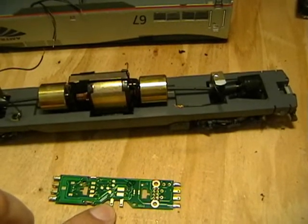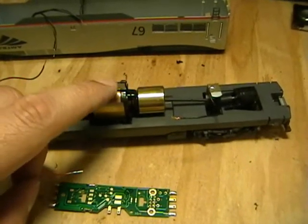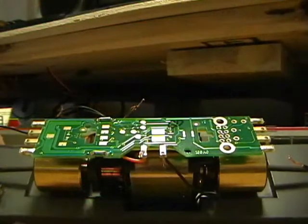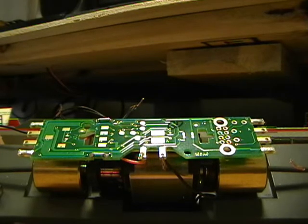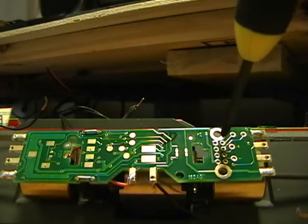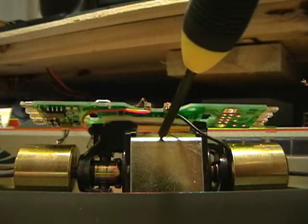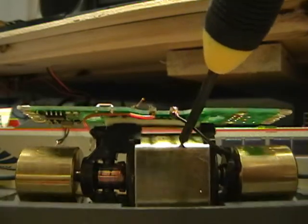What we need to do is take a wire - I use orange, which is the correct color for this - and solder it to the top of the mechanism and to the left prong on the replacement board. Then I'll put some adhesive or electrical tape on top to secure the board where the stock board was, while also preventing accidental contact from the new board to the top of the mechanism. Make sure the top part of the replacement board looks correct - if it doesn't look right, you've got it upside down.